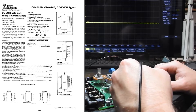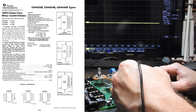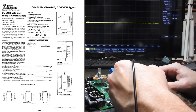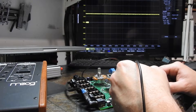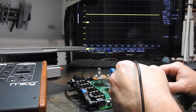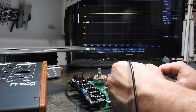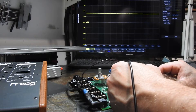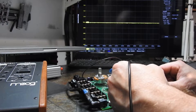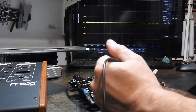Every time the button is pressed it will advance through the pins, and there's only one pin connected so this will probably be the first digit. It's working, but it doesn't seem to come back down to zero. If I choose another output, I can count my way there — one, two, three, four. That one goes down to zero. So the chip seems to be working, but the output of the binary counter is not being enabled to get down to zero.